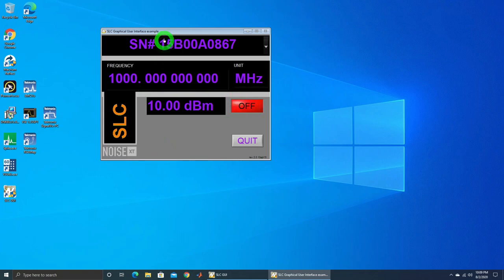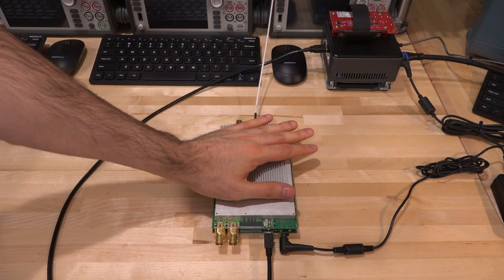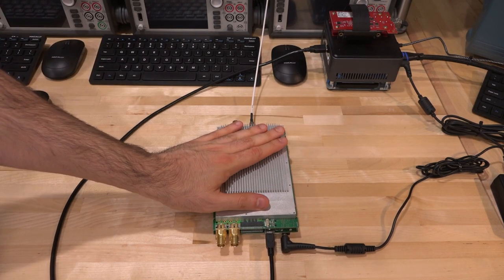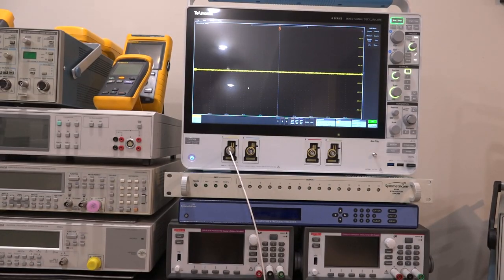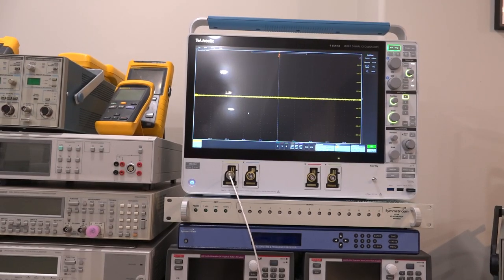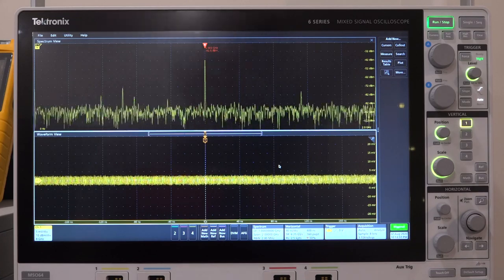This is just a sample GUI — you can write your own drivers in LabVIEW or MATLAB. It's set to 10 dBm at 1GHz. This thing is really really hot, almost too hot to touch — I wonder if that's normal, obviously there's no fan connected. And of course there is absolutely nothing at one gigahertz. Looking at five millivolt per division in spectrum view, we can indeed see a one gigahertz signal.